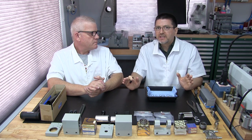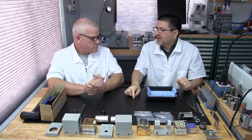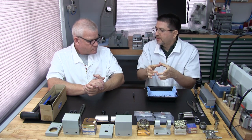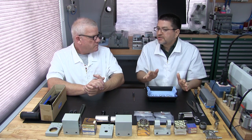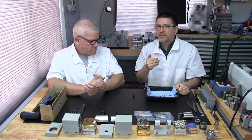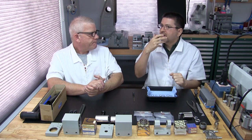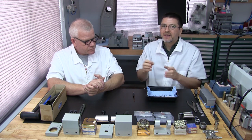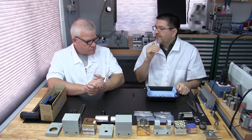If we had to custom make these, normally you would purchase some hollow punches, and with the hollow punches you would stamp the internal dimension and the external dimension, and you'd have your felt ring. But in our case, we measured all these felt rings, and they're very unusual sizes, like 12.4 millimeter. That's a problem, especially in metric. Usually if you buy metric hollow punches, they're only available in very standard sizes, like 10, 12, 14 millimeter, so you aren't going to get sizes in between. In that case, we would have to make the hollow punches ourselves.